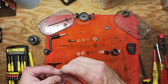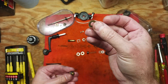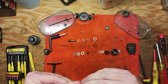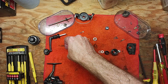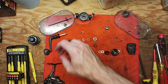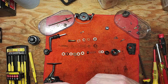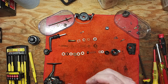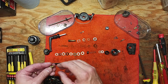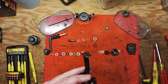We've got two keyed washers. I've mentioned in all the videos I do on rear drag system reels that they all do accumulate oil and grease at the base — that is normal. It's equally important to do regular maintenance on those reels because that oil will make your drag slip over time. A little bit of oil is not necessarily a big deal, but this is pretty soaked, so we're going to want to dry it up and clean it. There's probably one last washer down here — yeah, there it is. One little spacer washer.